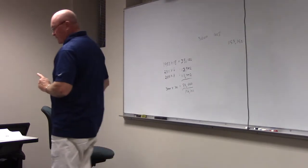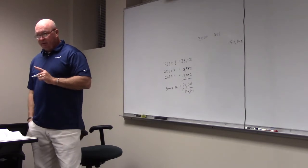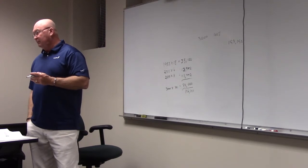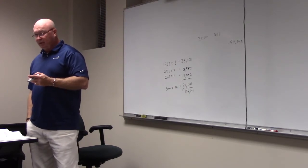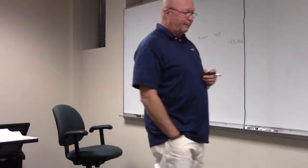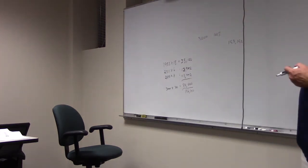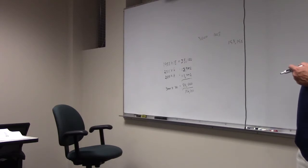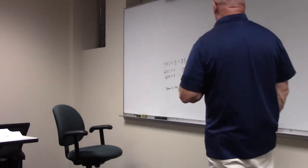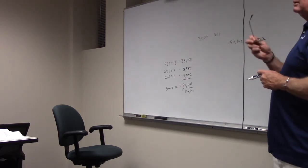But the code says what? We only go up to what? 120,000 only for 35%. Is that what the code says? I'm asking y'all. What does the code say? 35%. What do we go up to? Where are we going to in the code book? 220.42. And what does it say? Up to 120,000 is 35%. So we're going to take 120,000 times 35%? 117. Oh, thank you.